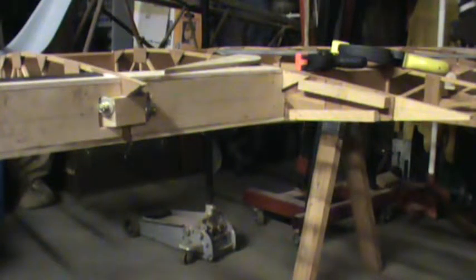The ailerons for the lower wing panels were started at the time that I got the project, and when you sighted down a trailing edge of the aileron, it was very apparent that the rib ends were not all in a level plane. So when I did the top wing, I built those ailerons in place as well, and it worked out very well. Today I want to give you an overview of that process and how it comes together, actually very simply, and the ailerons are in the alignment that they're supposed to be.